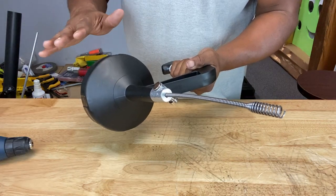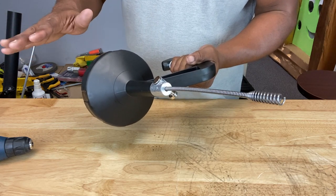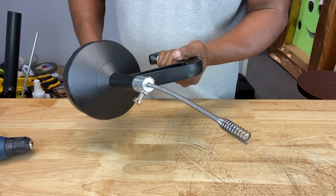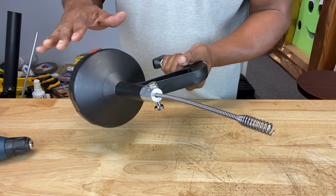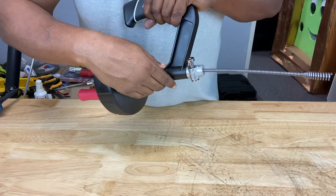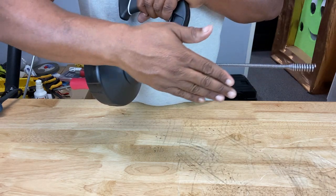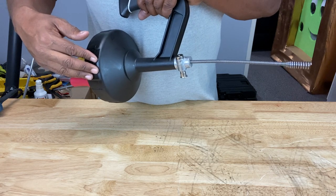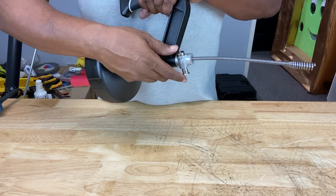Now when you're doing this, you're going to have your tub or sink filled with water, and the water won't go down because of the clog. But as you work the auger into the debris or the clog, the water will start going down — that's how you know you've broken through the clog. Once you've broken through, unlock the mechanism and continue to advance the cable further down the drain, all the way to 25 feet if you need to, just in case you encounter other clogs. Then just rinse and repeat.